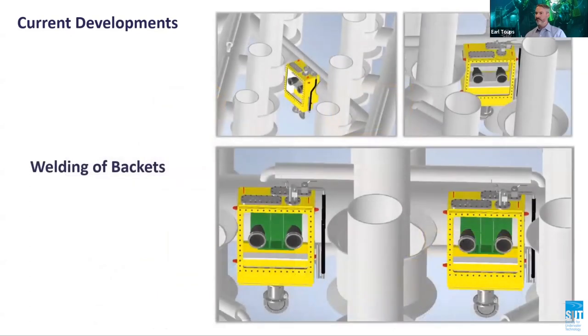The microhabitat can be used to weld on brackets in order to be able to bolt on supports or to strengthen existing structures. While the development of the microhabitat was intended initially for subsea jacket repairs, this technology can be applied to any subsea structure, making the prospect even more inviting to end users and customers alike. Moreover, the microhabitat can be used to execute corrosion or coating repairs.